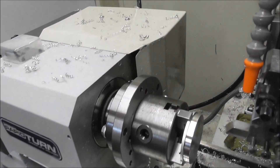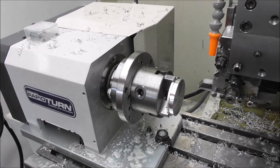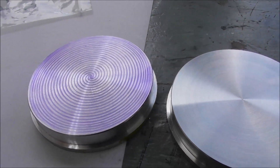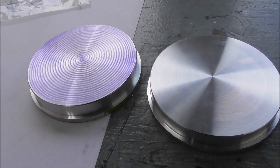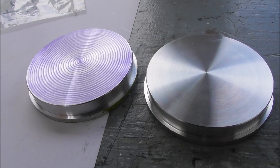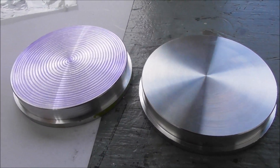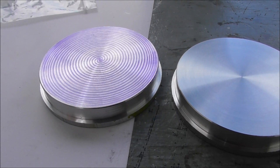As a summary of this first multiple-part metal turning production run: I had a really weird horrible surface finish when facing the parts — about one hundredth of a millimeter, or half a thou deep, coarse double spiral on most of the parts. Occasionally they came out really good. Because this finish is so even, it has to be to do with the RapidTurn software feeding the facing cut.